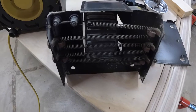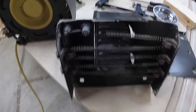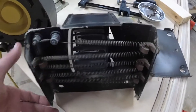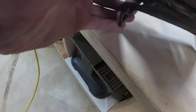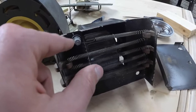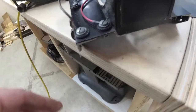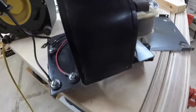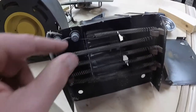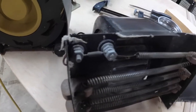After cleaning up this heater/fan unit and opening up the bottom cover, I'm gonna guess that this is the problem here, because I'm not getting any heat and the fan is not spinning up. If electricity isn't flowing from here to here, we're not getting the coils. And it's not transferring to this red wire, which leads back onto the transformer and the fan. I guess I'm gonna take this apart and see if I can figure out what this little component is right here. Pretty old, whatever it is.